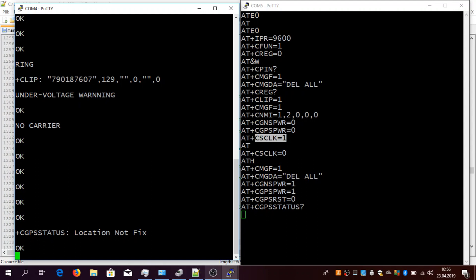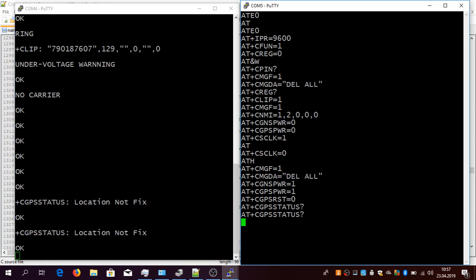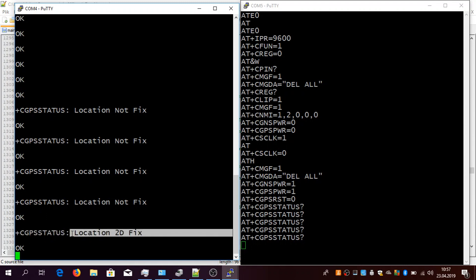The board and the MCU started the GPS positioning procedure. As you can see it's querying for the GPS status, and as soon as it gets the GPS status — which will be visible on the left side — I will get a text message with the GPS location. Depending on the coverage and the antenna, it will take at least one to four minutes. If it does not succeed, the device will go to the alternative way, which is querying GPS servers with the initial data — the base station ID. We can see that the location is already fixed, at least two-dimensional.